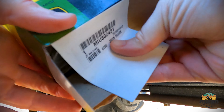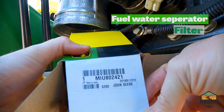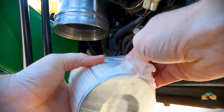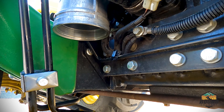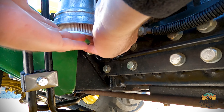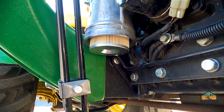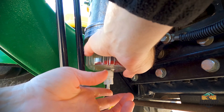The correct filter for your John Deere 3038E just pushes right back into its original location — make sure it seats. Then put back in the drain valve and the filter holder, and screw this glass or plexiglass bowl right back in place.